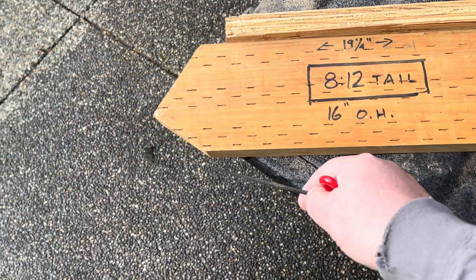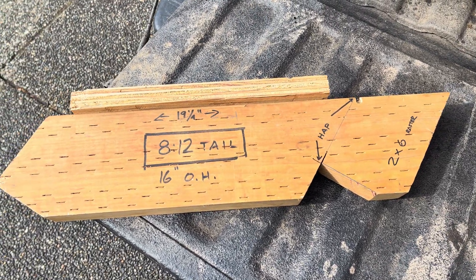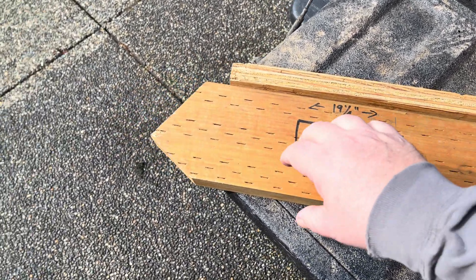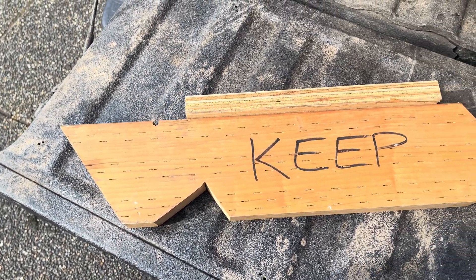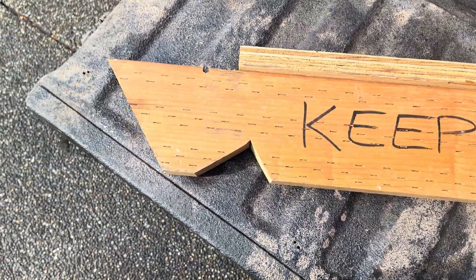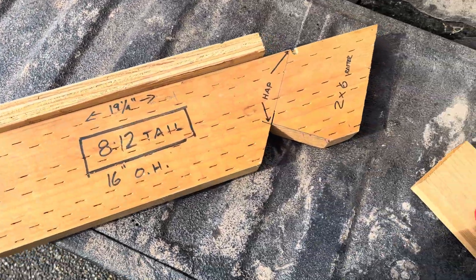Then, as I tip one forward so that I can cut it, all I have to do is cut all the far ends by the ridge from the tip down at this angle. Then find that mark I drew across their spines, slide this up or down until it lines up, and trace this pattern out like this. If you're using 2x8s, you would probably want to trace this bottom edge, but if you're using 2x6s, this is perfect. Trace it and then cut it. A lot of times I'll cut with the tail going this direction just because I'm right-handed and able to get in here and do all this work — there's a lot more cutting on this end than just one cut at the other end. So there you go — that's a quick tailgate talk.